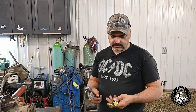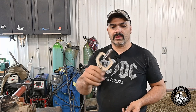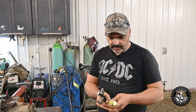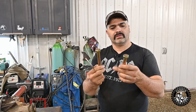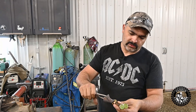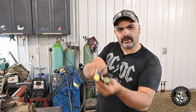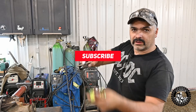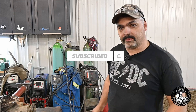So now we're going to make some shock mounts. I've already made four little mirrored pieces, all ground identically. We're going to take these five inch by five-eighths bolts, cut the heads off, cut the threads a little bit shorter, and these little pieces are going to get welded in here like this — and then that gets welded to the diff. I'm going to go cut these off on the saw and start fabbing these up.